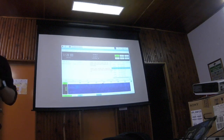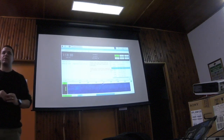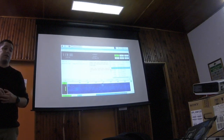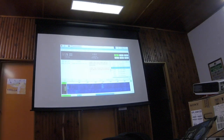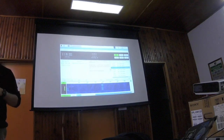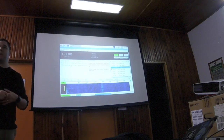I can work happily an actual conversation with West Coast US most afternoons and evenings on 40. 80, but 40 is too good at night, I find, for JS8, because I miss anyone who's within that 300k, 400k Melbourne sort of range. A lot of the VK guys are now using 80 as pretty much standard during the night, because of skip. And that's replicated through SOTA. In the last couple of years, we've had to actually drop to 80 to work people who we would comfortably work on 40 in the past.